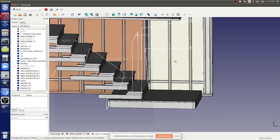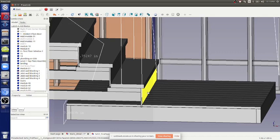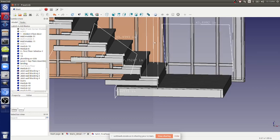Yeah. But that's without the siding, the interior siding, or the kick thing. So it would be, according to this, 41 3/4, because those are 3/8 for both of those. So if we talk about this, is this one here is what you mount first.